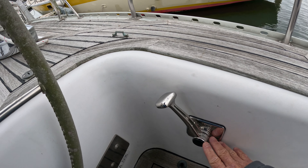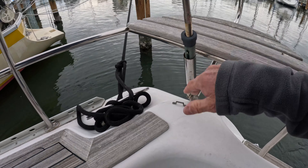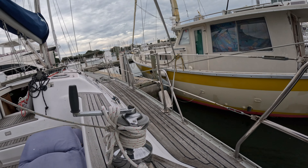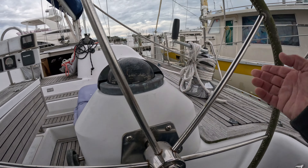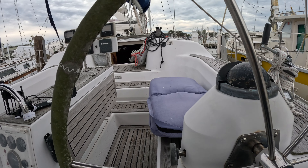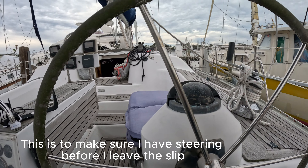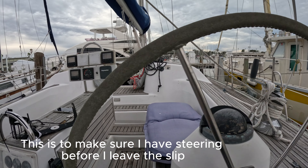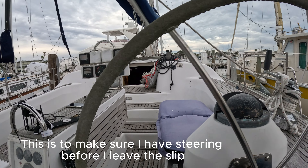I put the shifter in forward — you can hear that rattle, that's just probably loose wood. I can see the water circulating right there. I'm going to let the boat tighten up its bow lines. Now I'm going to exercise the rudder all the way, then count how many turns it takes — one full turn, two full turns, and a quarter. So two and a quarter turns total. Now I know that if I go one full turn, my rudder is straight. That's the trick — you need to exercise these things.